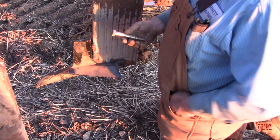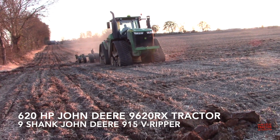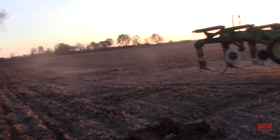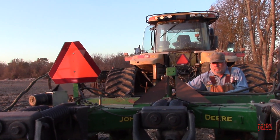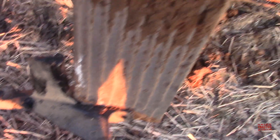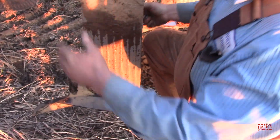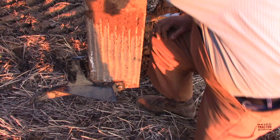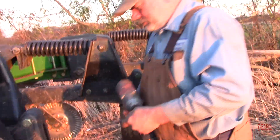That's actually a point off of a DMI. So here we can see the point — that's what's doing the fracturing. And then this gives it the stabilization. This is something we build right here, it's not a John Deere part. I've seen mat welding on those in the wintertime. Does that extra groove just give it extra life? It makes it want to last so much longer — probably saves it about 50%, maybe more life on it.